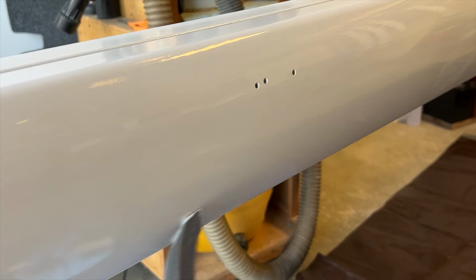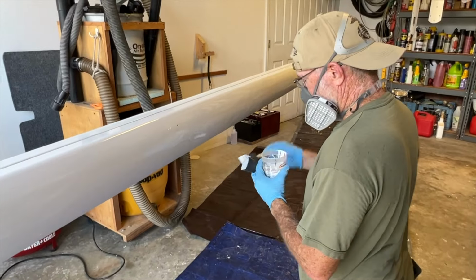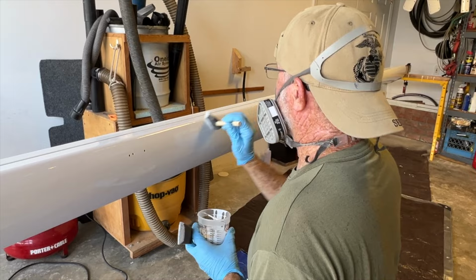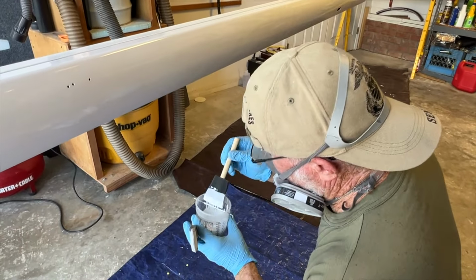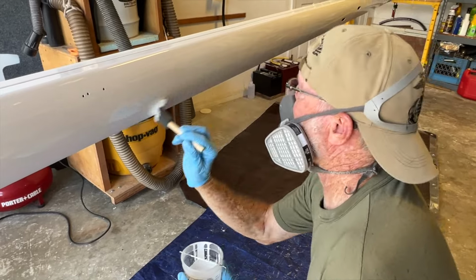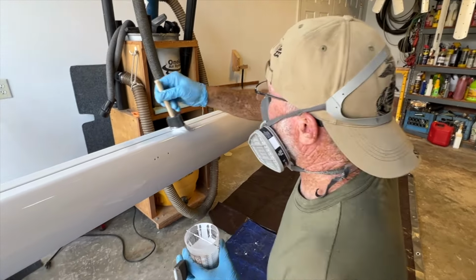And that's all there is to it. You do one coat a day, sand between coats. So spray, and three coats a day and you're done. No sanding, rolling and tipping. One coat a day, sand between coats. So it's more work, but it's safer, and you don't have overspray and all the equipment that professional sprayers have to have.